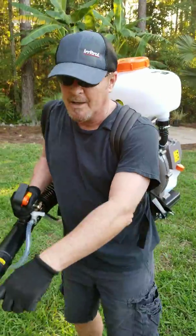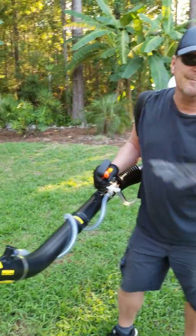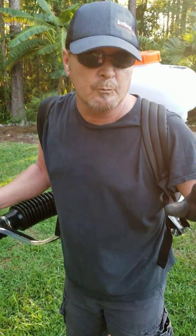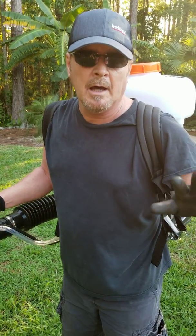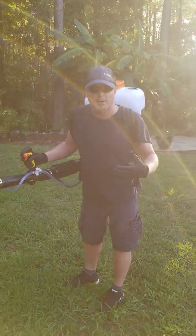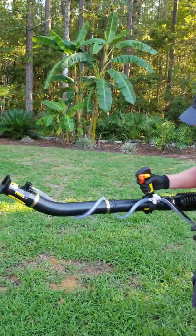Let's see what we've got going here. That's allegedly the atomizer — that's going to atomize the water as it comes out of the air. I think the range on this is somewhere around 30 feet at prime distance, which is pretty good for a portable pressurized backpack sprayer. You have to let this thing build pressure for a few minutes so that it'll pressurize the tank and get a better throw out of the wand.